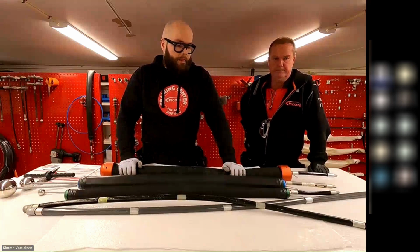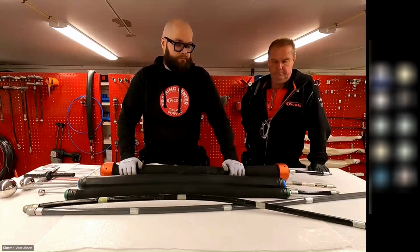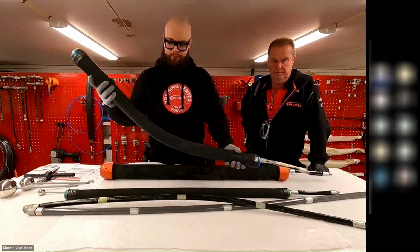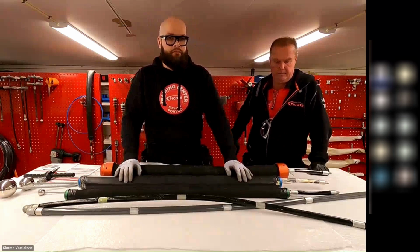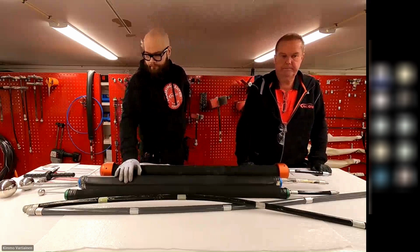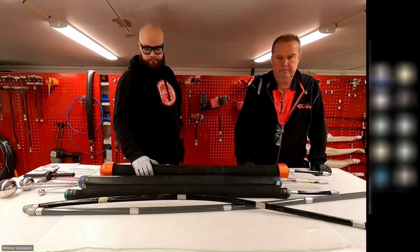Yeah, well, the 3D obviously is built and designed for straight pipes. The Bendy is really designed for bends. You can use it in straight pipes. It doesn't last as long in straight pipes as the 3D packer will, so it's a much better choice for bends, but it will operate in both. I would personally recommend it more for the bends and purchase the 3D packer for your day-to-day straight runs. Just long-term investment cost, it's a better deal.